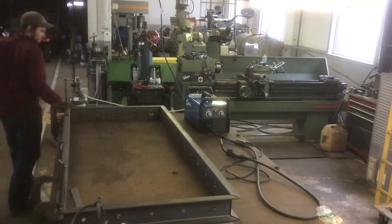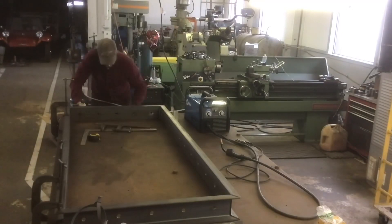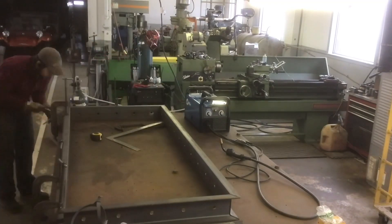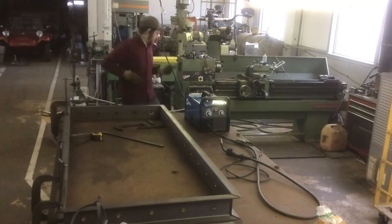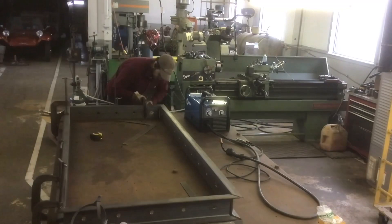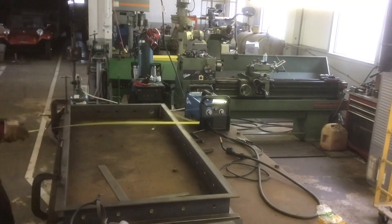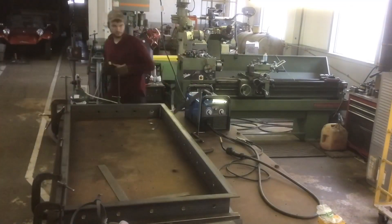This project — and actually the last few larger framing projects I've worked on — taught me I need to invest in some Fireball Tool squares to make squaring things up a lot faster. This is a 5x10 welding table, one inch thick, all Blanchard ground so it's really flat, which I love. One thing I wish I had were some holes in it — I'll probably end up getting some Certiflat tables just for framing jobs like this. You can't drop a clamp in the center of it, which tends to be a problem sometimes.